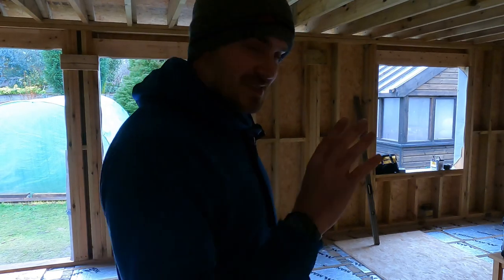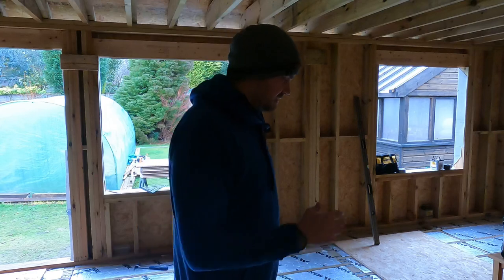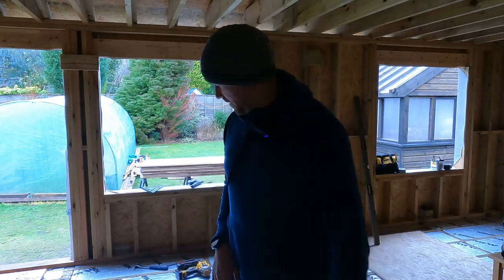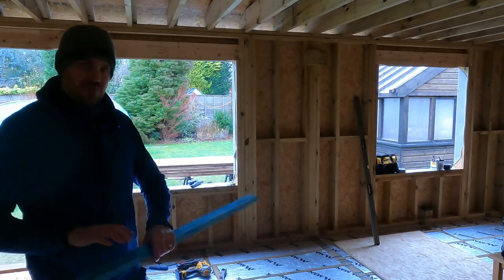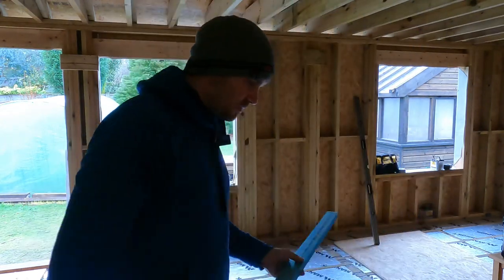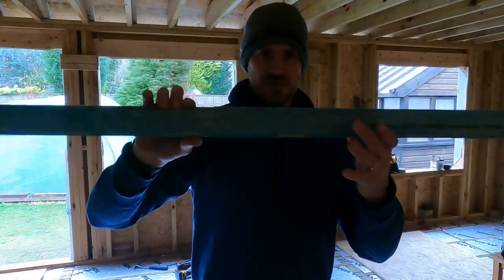And then on the Celotex that I fitted, I don't know how long ago it was that I fitted it, I just put it in there under pressure. Then I went back to make room on site really, because there was so much stuff here. I've used some 2x1 roofing batten and gone in between the joists and come down the joist to where it needed to go.